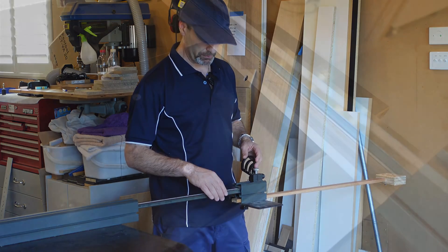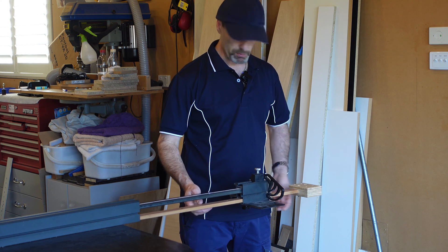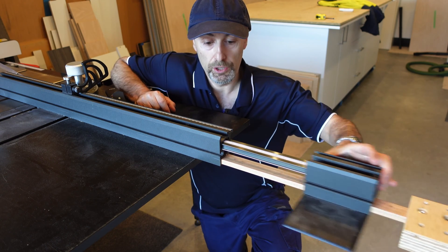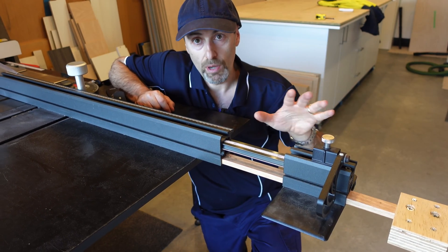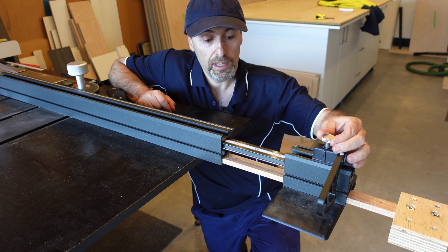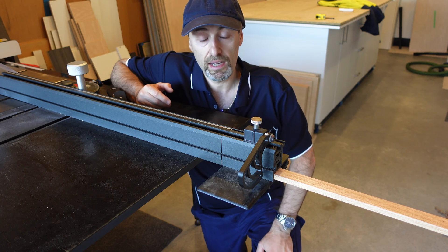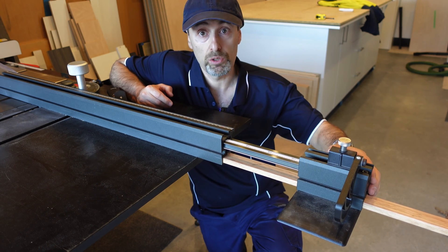This does need to be supported when doing long pieces — I usually have a support running through the middle. It was just something simple I did to get those repetitive cuts at a longer measurement when needed. Now, the original SawStop sliding fence does have this extension piece that slides out and you can put the stop on the end of that, but you are governed by how far it comes out, and to an extent it does start to sag — hence why I made this extra stop.